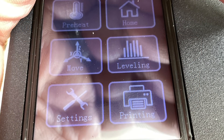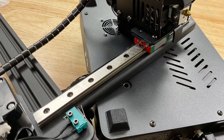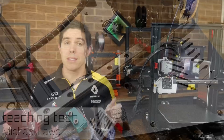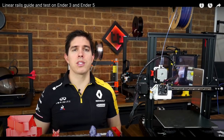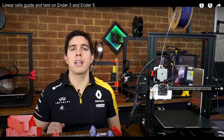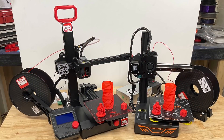The firmware does have a leveling menu — you click on it and can position the head at any point on the bed. It doesn't position exactly over the adjuster but it's close enough to use the paper method. Many people told me this is a better machine because of the linear rails, but I've never really seen a clear advantage. Michael Laws over at Teaching Tech did a great review of linear rails versus wheels, and his conclusion was that linear rails are not a magic bullet — if your machine is already running well, there's very little chance of a big improvement. I'll link to his video in the description.